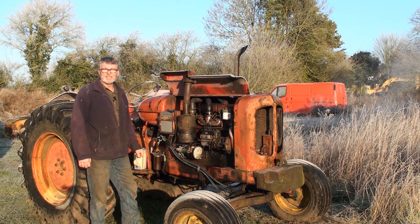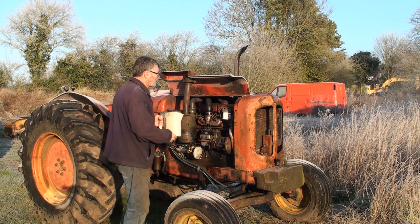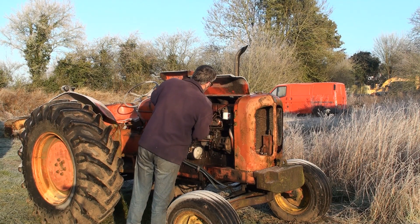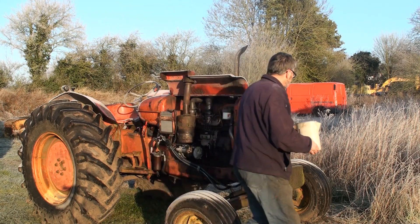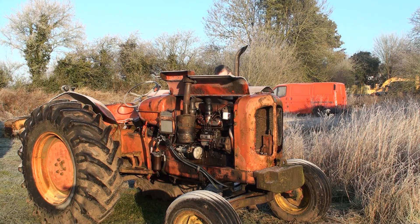Times like this people might reach for easy start, but there are other methods — like put the kettle on. This kettle's just been boiled and I'm going to warm up the manifold. This tractor's got a turbocharger on it so I'll just go around the other side and warm that up a little bit. The idea is that you get the air going into the engine warm — trick the engine into thinking that it's warm.